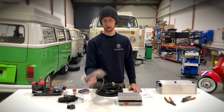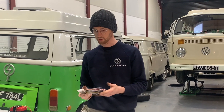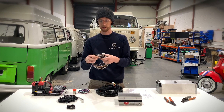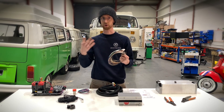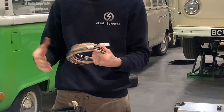You will receive this main loom, which goes in the side here. Like I mentioned before, it has discharge enable, a bunch of signals to turn it on, and it's got a CAN bus connection which you can use to talk to it through your laptop, to talk to the drive unit, to talk to your charger, and to talk to the dials on the front of your display — which is one of the great things we use it for in our conversions.